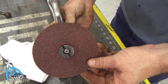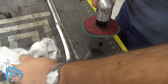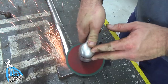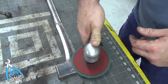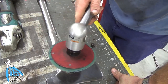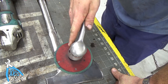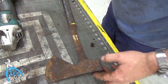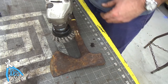We used the DA at first but now I have this rotary sanding tool - it really moves a lot of material quickly. As they say, it's going to get worse before it gets better - this is really going to take off a lot of material. So far this seems to be the most effective tool. It will not leave the desirable end finish - I'll still need the fiber wheel to get that final finish - but this seems to be the most effective in terms of speed. But while I'm showing you all these different rust removal tools, let's use the old standard - the four-and-a-half inch angle grinder - and see how quick it works on this side.